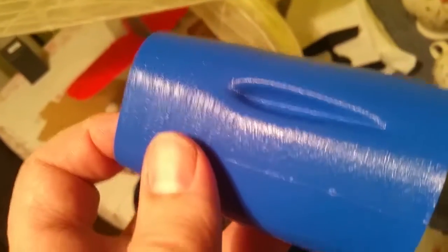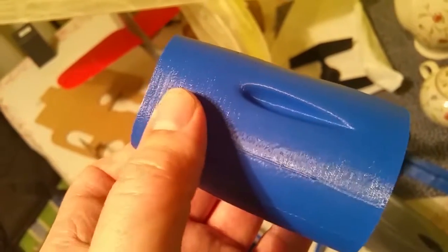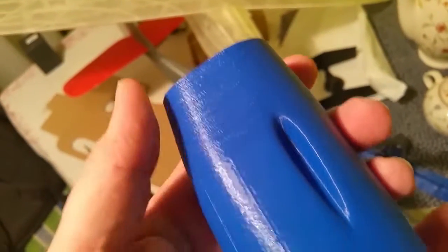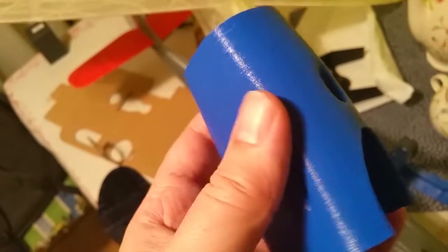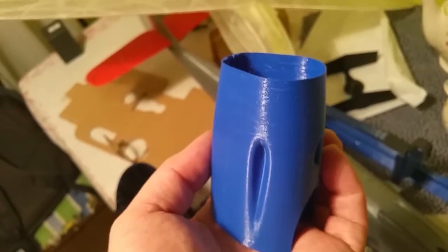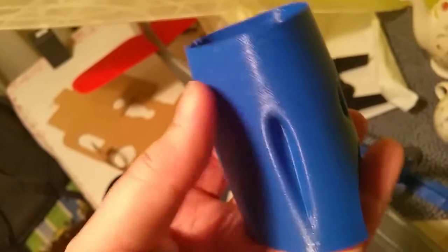Of course you can add cooling by fan, but 3D LAB PRINT does not recommend printing with fan cooling, and I agree it will make some next problems. Just print more parts with the same temperature, or use lower temperature, or combine both methods.